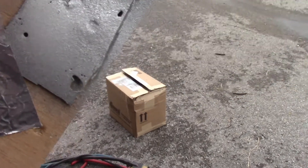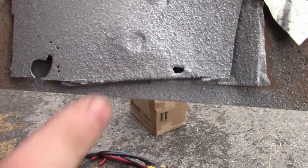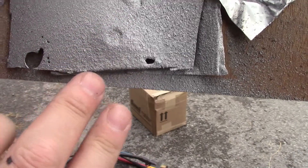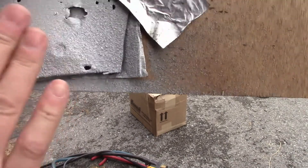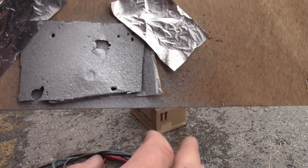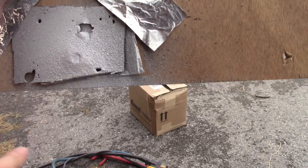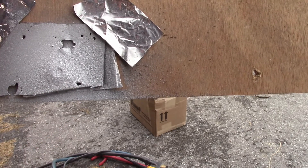I actually did more passes. You can see when I grind it, it'll level out — it shows the lower spot still. I could have kept building this up but I know I'll be grinding for a while. This is hot but not hot enough to catch fire. I let the wire feed out too far and it was too close — I actually burned a hole in this because it arced on that. That was my fault, not anything with the machine.